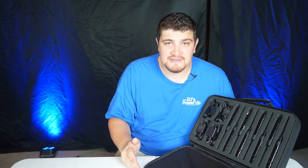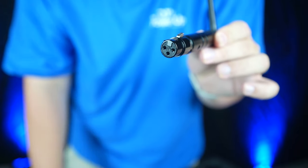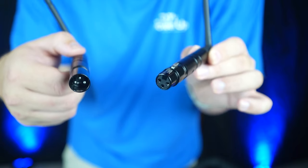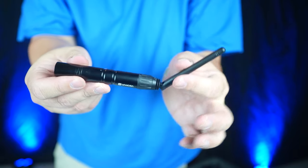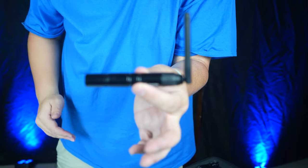This will even work with your wireless DMX uplights that have built-in wireless DMX receivers, as long as it's normal wireless DMX. The receivers have a female XLR, and the one transmitter has a male XLR. One transmitter can transmit to many receivers — they all have to be on the same band. Each one has an antenna that can go straight for storage or upright for optimal transmission.